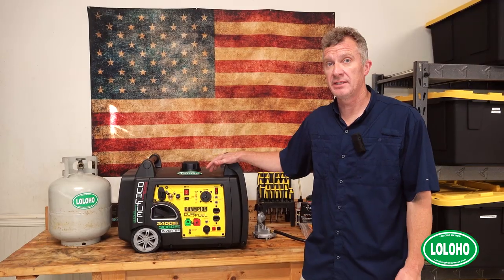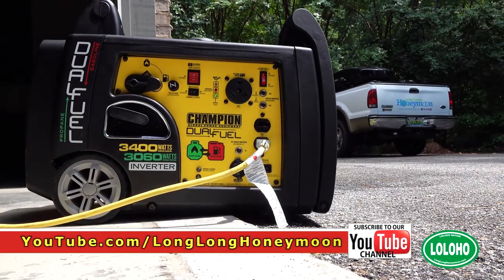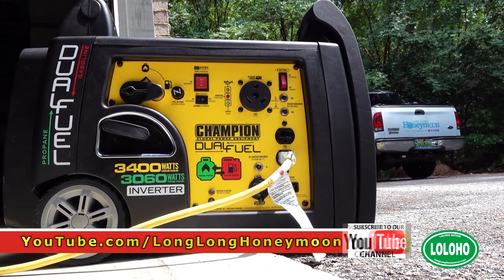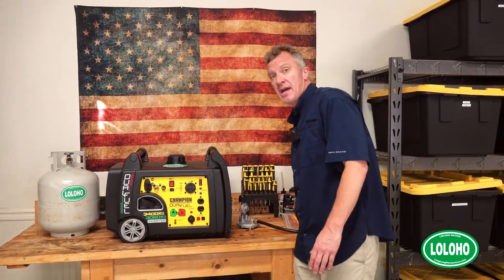You really ideally should put the generator through a little break-in period. The break-in period lasts 5 hours. During that time, they want you to be running dyno oil, or old-fashioned non-synthetic motor oil. After the 5-hour break-in period, you can switch over to synthetic oil if you prefer. And by the way, I always put Archoil Friction Modifier in my engines.